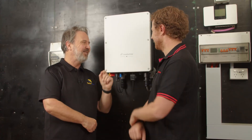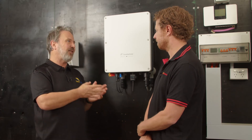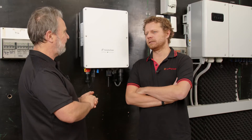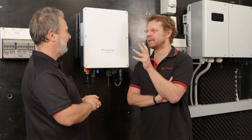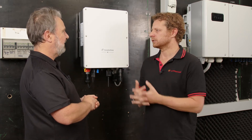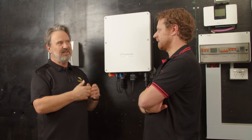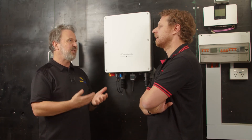The inverter just went through its startup process and is now flashing green. Because we're at the Smart Energy Lab running our own grid, the grid frequency is a bit different from a stable utility grid, and you can adjust those settings in the app. Not everyone can adjust the frequency - we don't want end customers playing with inverter settings - but if you're a skilled installer with approval from the network, you can definitely change the frequency. There are standards to comply with, and networks have their own requirements on top. We're capable of making those adjustments in response to DNSPs.